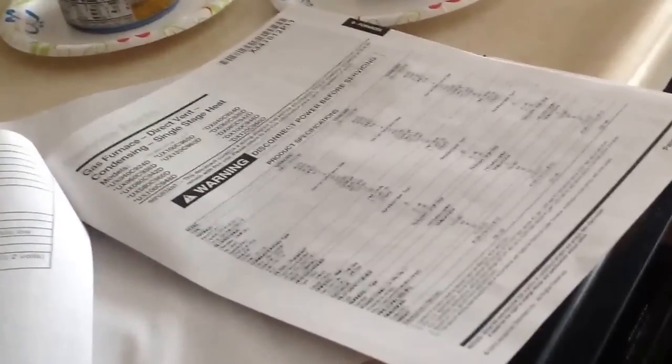I just wear my shirt sleeves and enjoy it. That is the instruction manual for my furnace. I had to look up the flash codes because the thing malfunctioned on that generator. And I'm going to tell you exactly why, because the very same thing may happen to you if you use an arrangement similar to this. My generator has what is known as a floating neutral, and I know that for two reasons.